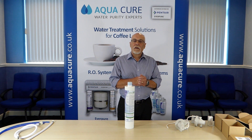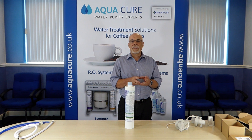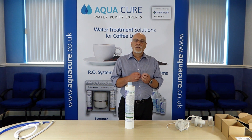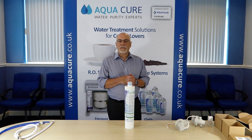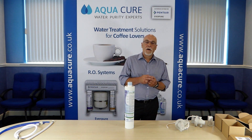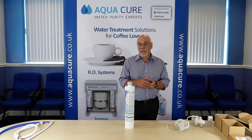You may also have an optional Everpure water meter to determine when the cartridge is exhausted. You might also have some extra John Guest fittings depending on whether you're installing on tubing or on braided hoses. If you do need assistance establishing which size of filter you need for your application or usage, then please feel free to contact us for advice.